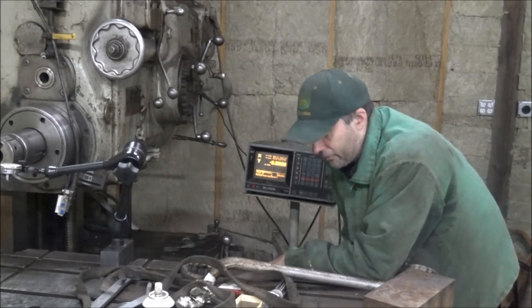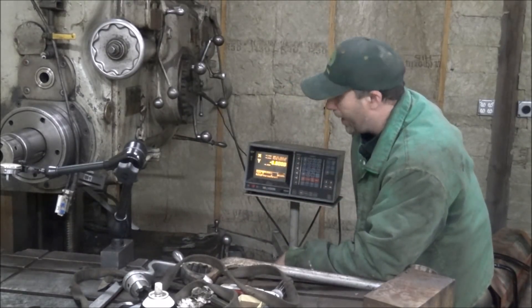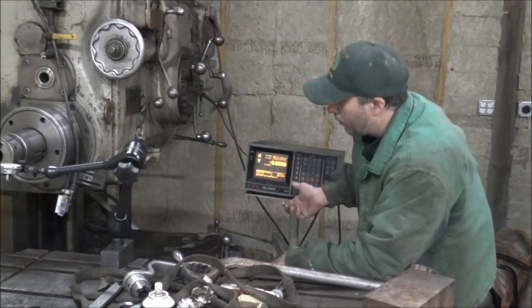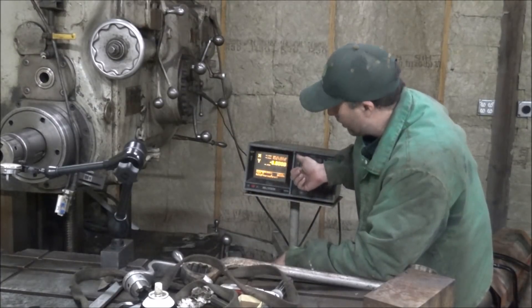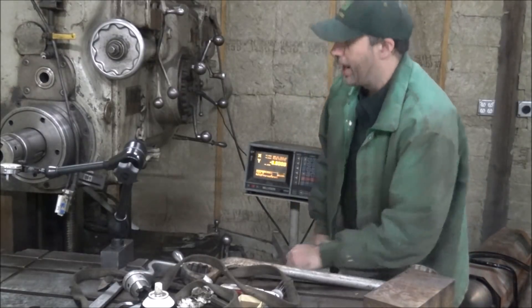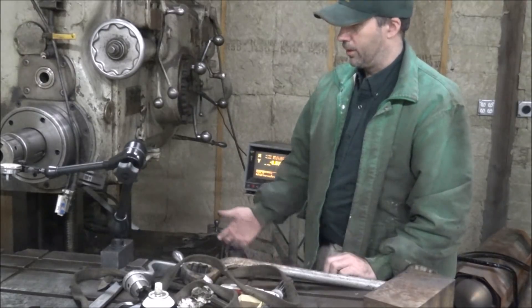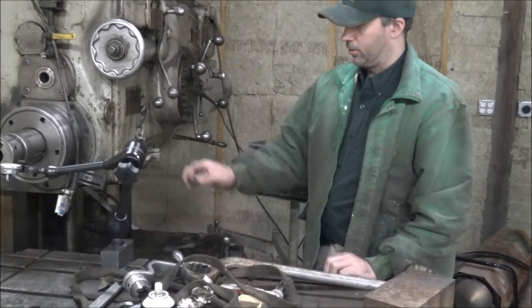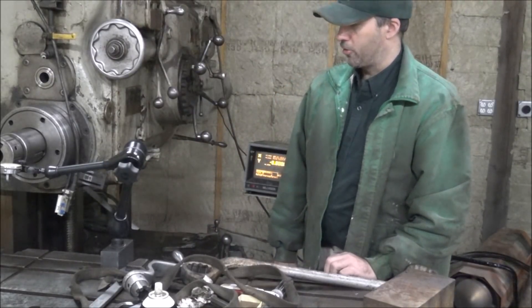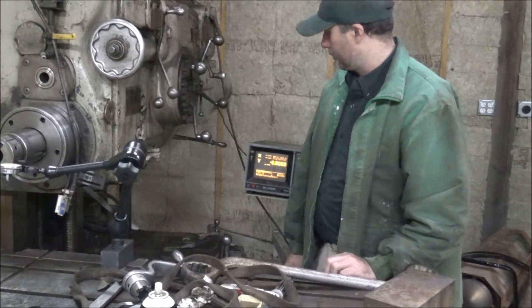I think with the proper tooling, like an oscilloscope to hook onto this thing, to get them balanced out, I can get this working again. I'm not sure why they went to not working, unless it's just the load of having two axes plugged into this that has affected the voltage balance on them. I tried using the voltmeter on the lead wires, but they all read the same voltage, and turning those resistance pots didn't seem to make any difference as far as what that voltage was. So I can't really tell what I'm doing with the tools I've got.